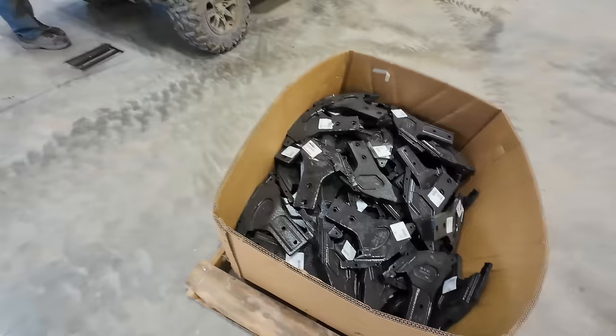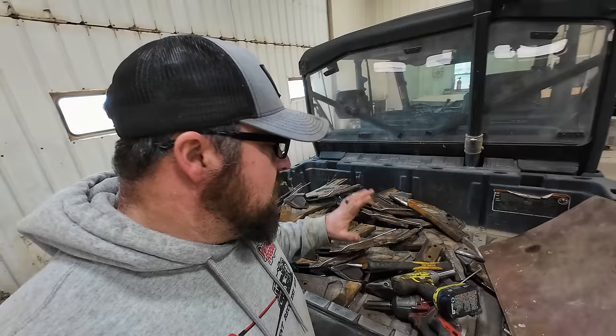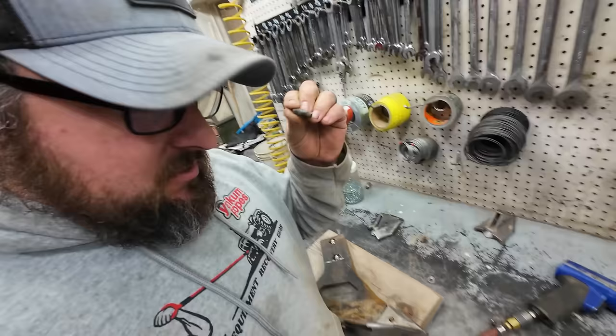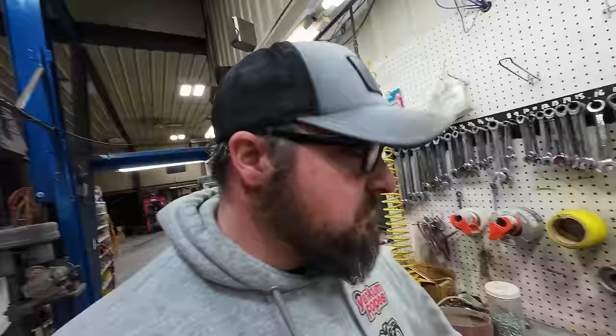Yeah, that's not even half of them. We got a lot more to change on that air drill. You're wondering, why are we taking all those boots off and putting new boots on? Well, that's a good question. Here's the reason why. The roll pin that holds the point on, here's a point, as you can tell. Here's the roll pin. You pound it in, as you can see right there, and it keeps it on. Just friction, that's all it keeps on.